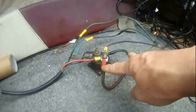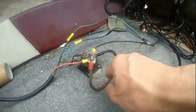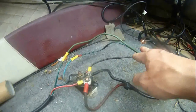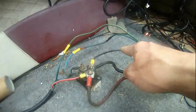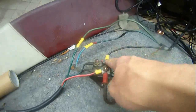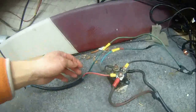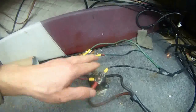These two wires came from the batteries — big terminal and small terminal for the positive and negative from the 12 volt battery. These three wires came from the tilt and trim motor. The black wire from the trim and tilt motor is connected to the small terminal, and the blue wire is connected to the big terminal on the starting solenoid. That's how the three wires are supposed to be connected.